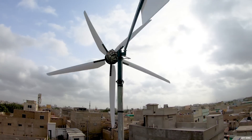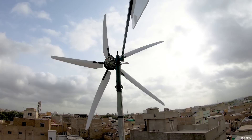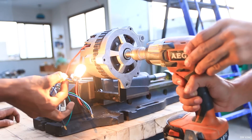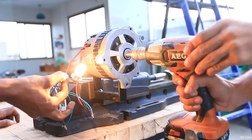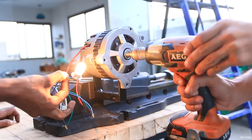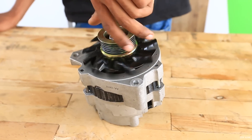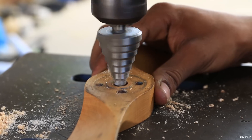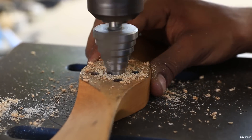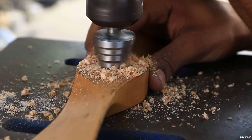Is 1200 RPM good enough? Not yet. Wind turbines typically spin at around 700 RPM, and even with step-up gearing I doubt it will spin the rotor fast enough to produce a reasonable amount of power. This might be resolved by using a 24-volt alternator and somehow decreasing the cogging effect — but that's a subject for another project video. This alternator needs to spin that fast just to produce 12 volts, so imagine what it's going to do when we run it on 42 volts.